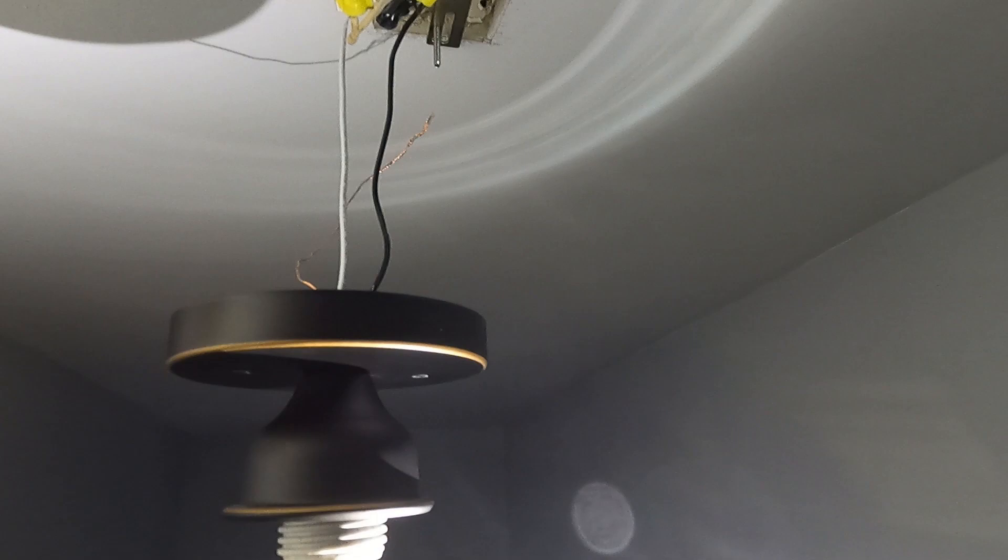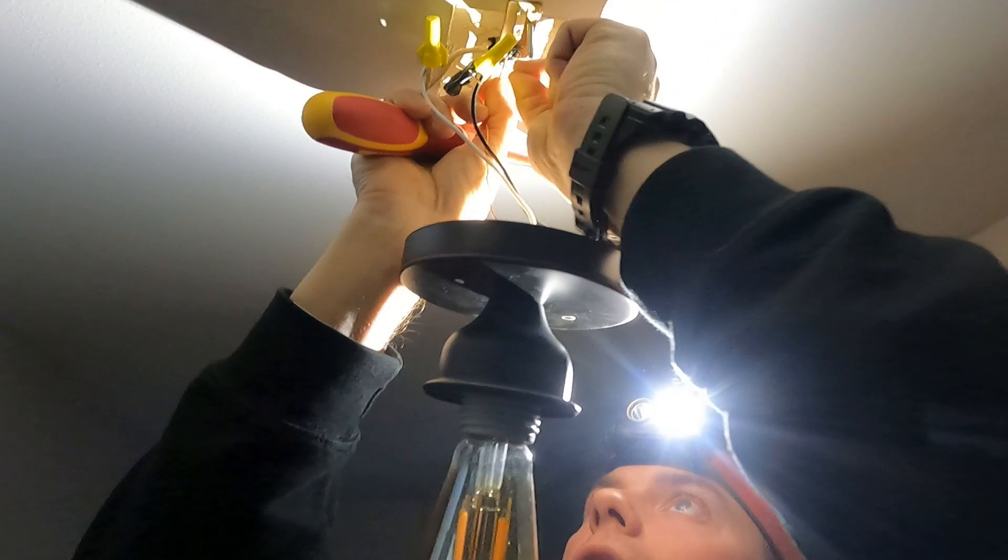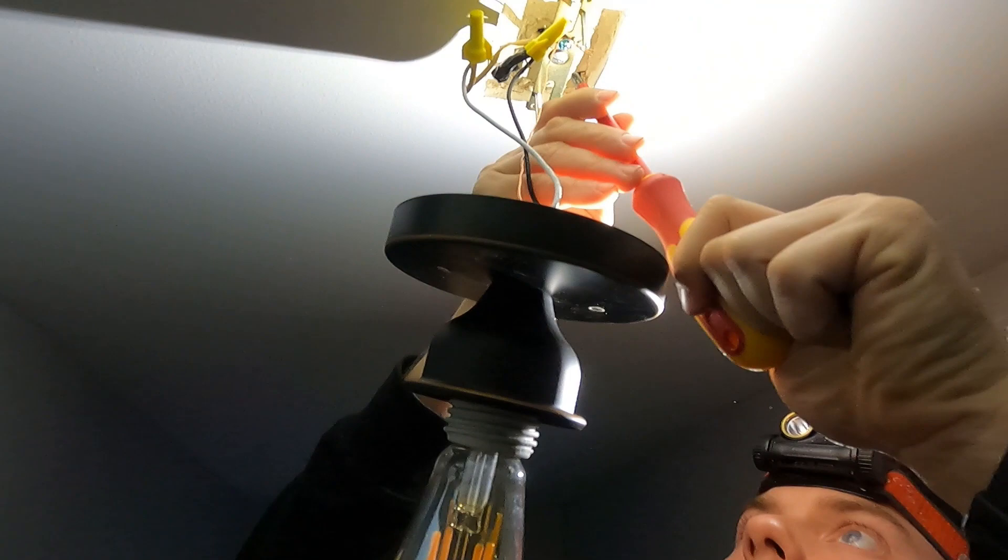Your green is always your ground. So we're going to take our Phillips head screwdriver and loosen this. You don't have to take it all the way out, but you want to loosen it enough so that you can put your wire around it — just wrap it like that. So as long as it's connected, it's grounded. Then you simply tighten that screw up and that just holds it tight to that mounting plate.